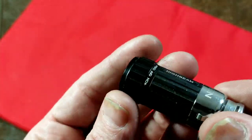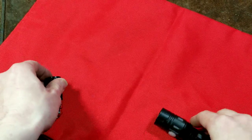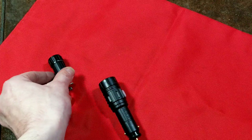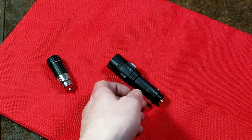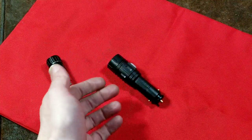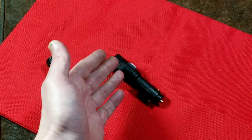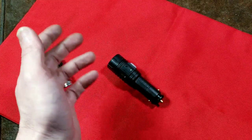I kind of like the Nebo because it has a charge cutoff function — when it's off, everything is disconnected, and you switch it to charge or to use the light. The Harbor Freight does not have that cutoff. The reason for having a cutoff is to make batteries last longer. Any battery chemistry — whether nickel metal hydride or lithium ion — suffers from being left on the charger. Even lead acid batteries, when fully charged, need to be reduced to a very low trickle charge. Trickle charging isn't just about limiting current; the voltage also needs to be just barely high enough to put power into the battery.